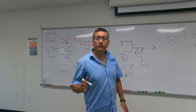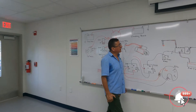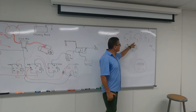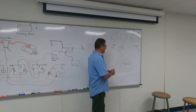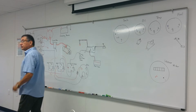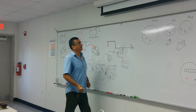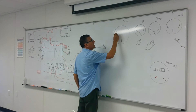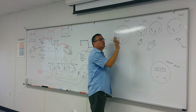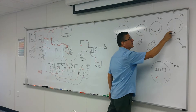Okay guys, now in this second part of the explanation, we are going to connect the tachometer, the oil pressure gauge, the temperature gauge, the fuel pressure gauge, and the hour meter. That's the last part of the system. We are going to start with the tachometer. The tachometer normally has ignition, ground, and signal. Each gauge has three terminals: ignition, ground, signal. The hour meter has two terminals: positive and negative.